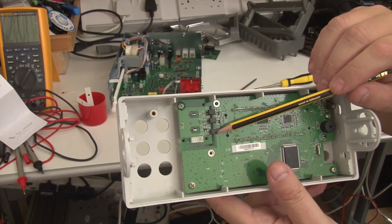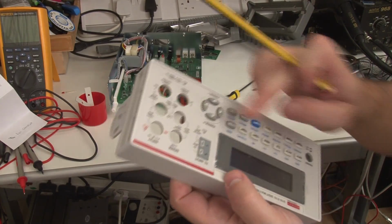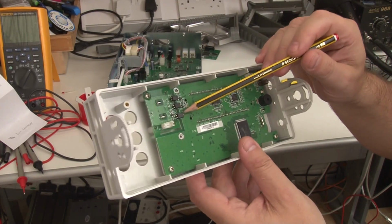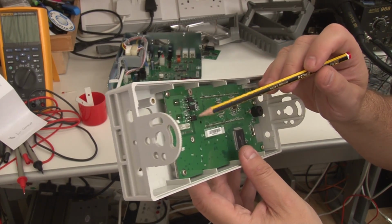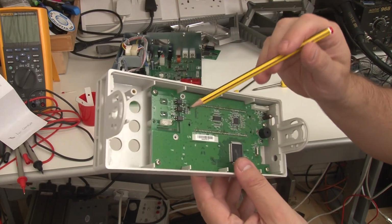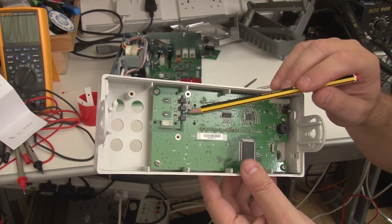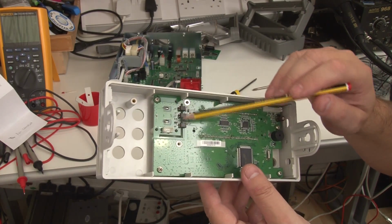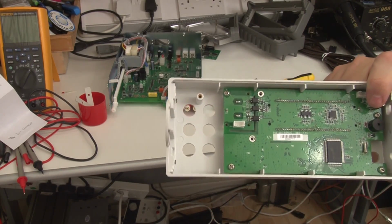But there's also these opto isolators taking this circuitry here, and that circuitry is just this temperature sensor, and bringing it across here. I find that's curious. I have no idea what that's doing. So I can only assume that this microcontroller is dealing with doing the temperature, and this is bringing power up to power this circuitry, this side of those optos. Let me see if I can identify those optos. Maybe that'll shed some light on what's going on.